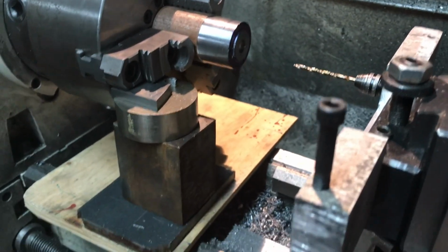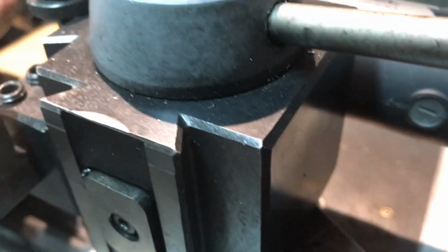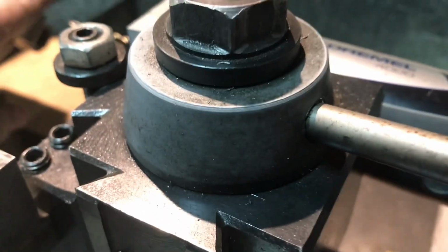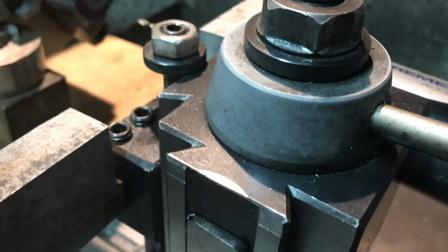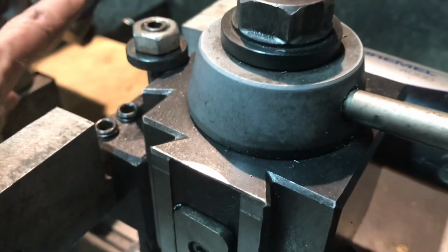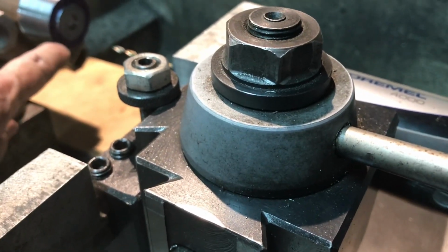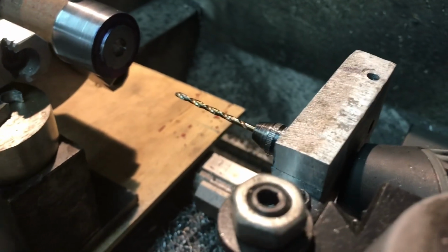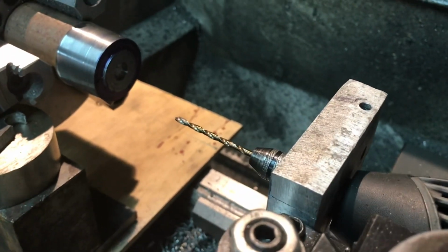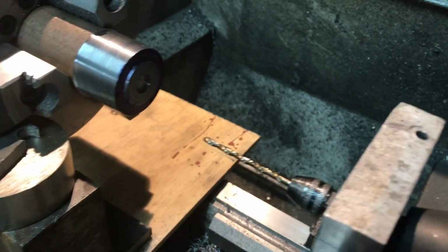So here's the trick I was going to talk about for drilling the 3 holes, the clearance holes for the 440 screws to go into the right side of the casting to hold the spring pocket. Here's the spring pocket. As you can see, I blued the shoulder area, and then I used calipers just to kind of mark off what is an 1/8 inch in from the end. So a 1 1/4 inch bolt circle diameter.